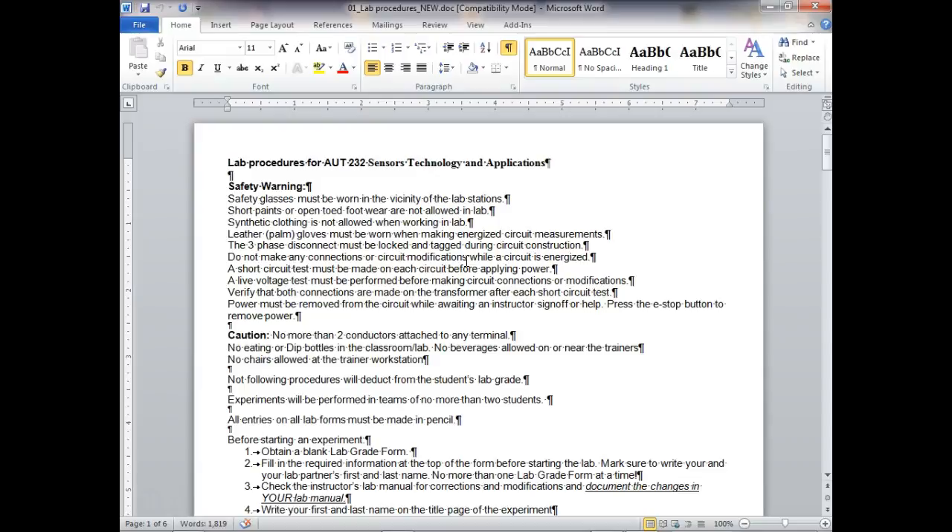The relays we use in here have about 2,000 ohms of resistance, and that's why we can put solid state limit switches in there. When you hear the term solid state limit switch, the inductive and capacitive sensors use the same symbol in electrical controls. We'll look at those today and also go back and look at the symbols used in motor control.